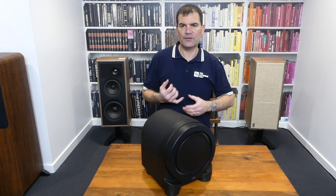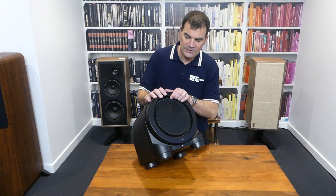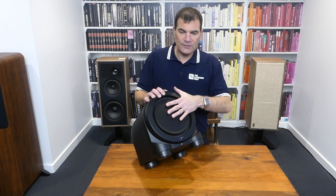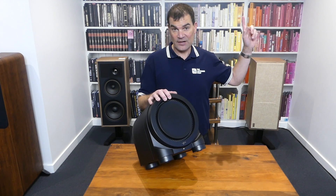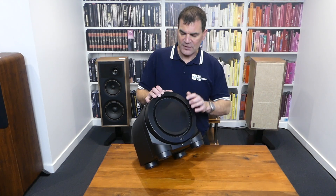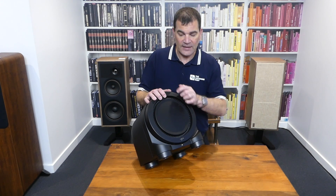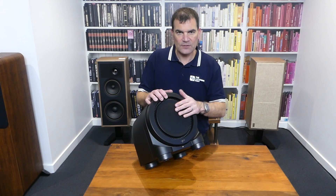Its frequency response is down to about 18 hertz, and this is all from a little 10-inch driver. In fact, this model has been available for so long that back when I was looking much younger, there's an unboxing video for it. It's awesome. It uses a reverse annulus, which was one of the first emerging technologies for subwoofer surrounds and annuluses. It also used a polymer drive unit for the woofer.